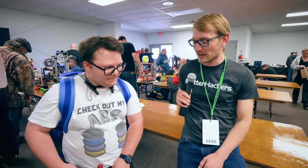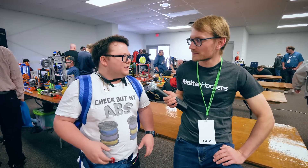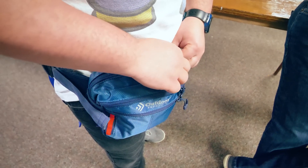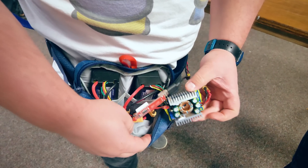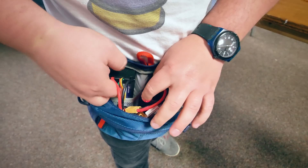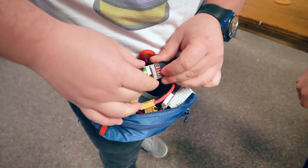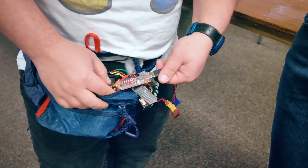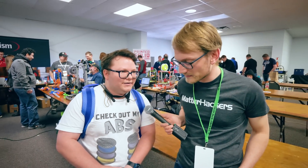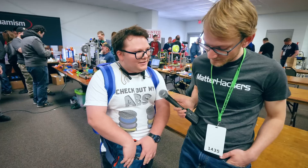I haven't run out the whole convention. You have no idea how long the batteries actually last? Not really, but I estimate it's about 5 amps draw, so I'm probably going to get about two to three hours nominal. I have a DC-to-DC converter — because the 4S batteries are about 15 to 16 volts, the 3-volt regulator on the Rambo board would probably fry if I connected directly — so I have a DC regulator that I've tuned, and a 5-volt regulator for the USB output from my Pi. I'm using XT60 connectors so it doesn't break. It gets a little warm but hasn't been a problem. I'm also using the fanny pack to hold my glue stick, business cards, and maker coins — it's actually been convenient.